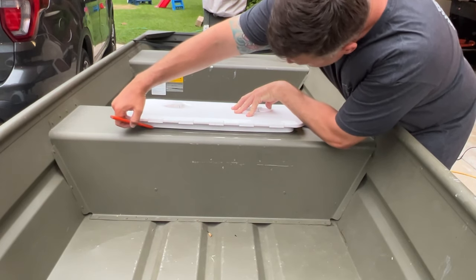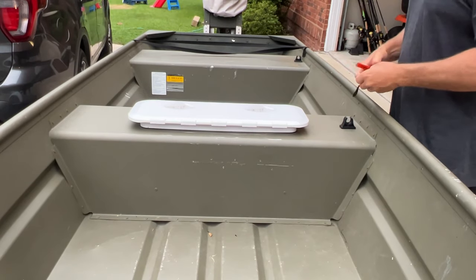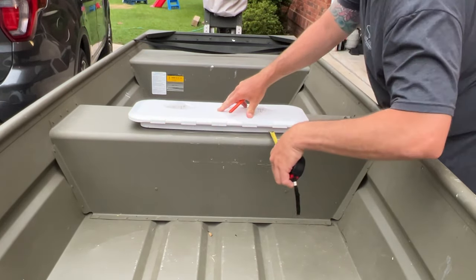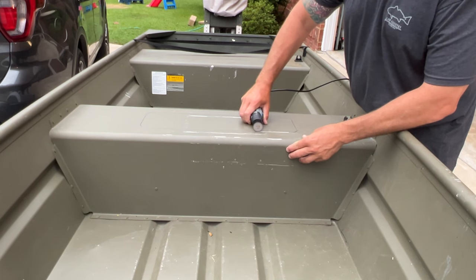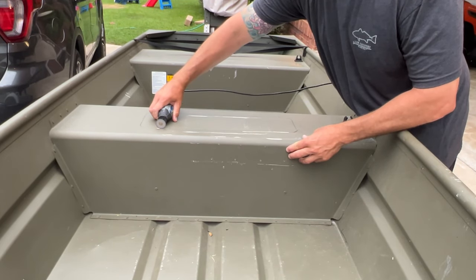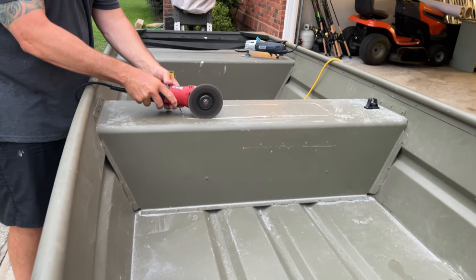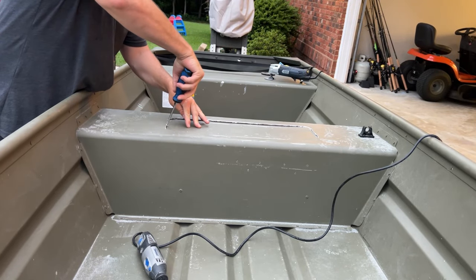Once I got the hatch, I set it on the bench, centered it up, took a couple measurements, then pulled out my carpenter's pencil and made a circle all the way around — showing exactly where I needed to make my cut to insert it into the aluminum sheet metal. I had two tools in mind: my Dremel with a metal cutting disc for a nice precision cut all the way around, then my six-inch angle grinder to get the job done quickly once that line was made.